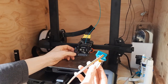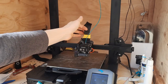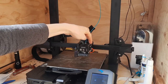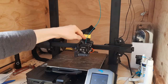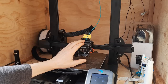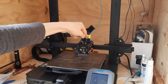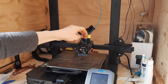Originally I was thinking I would plug this onto the ribbon cord - find out the pin out - because the cables from the probe just go straight through the PCB on the back with no circuitry. I was going to do it that way so I'm not touching the extruder plugs at all. But the problem I found is that the plug on the back is not common - it's a two millimeter pitch, whereas standard header pins are 2.54 millimeters.